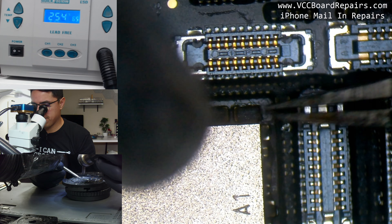What I can do on my multimeter is set it to diode mode. I'm going to check for shorts on the pads — red probe on ground like NAND, black probe on the line I want to measure. I put it here, I put it here, I get 254 — in that mode the other pads are going to be ground, so that's normal. That tells me there's no more short on the line. Next I'll check the capacitor itself: capacitors should not have continuity across them. I'm touching each pad and I'm getting 0.000, which means short — continuity across from probe to probe. So this cap is shorted and the line is no longer shorted. That tells me the board is fixed.